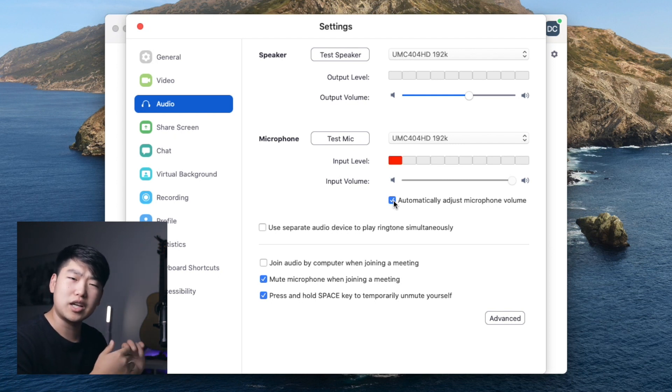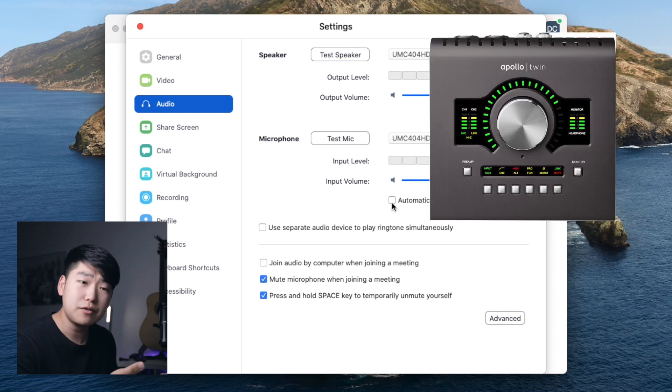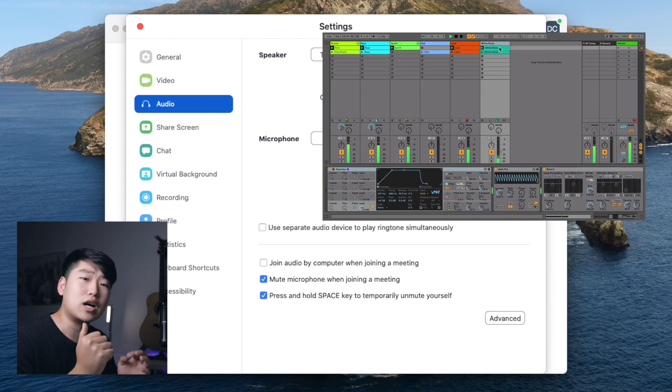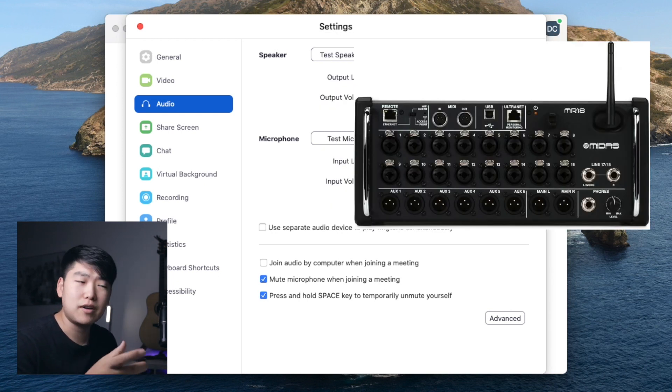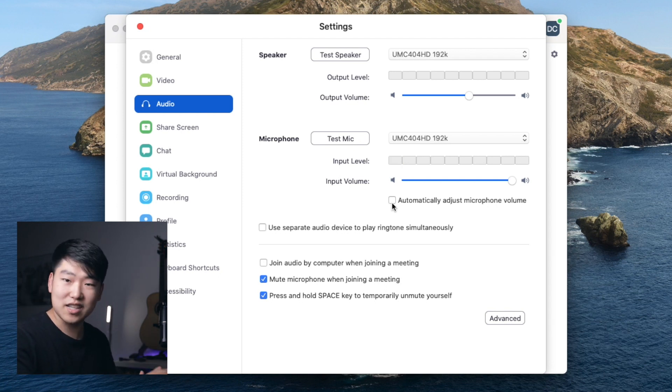However, if I'm giving a concert or a performance through Zoom, I'm not going to turn this on. If I turn that off, all the dynamics within your mixer — whether it's straight through from your interface, routing it through a DAW, or going through a digital mixer — will be preserved. I would recommend adding a limiter or a compressor to the main mix bus before you bring it into Zoom so that the levels are fairly high. Otherwise, other people are going to have to raise their volume and then lower it quickly when others talk because other people are going to be a lot louder.